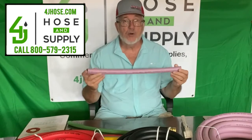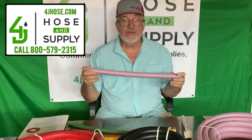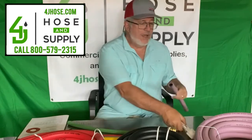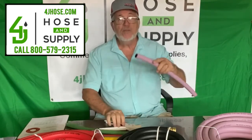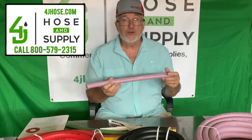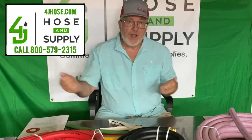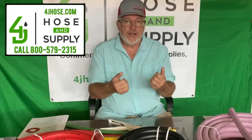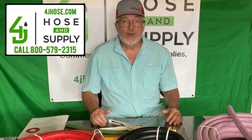This is the non-potable water hose, also called reclaimed water hose. You're probably familiar with pipe and PEX tubing, but this is something that goes in between. It's a very durable hose, made to be outside, and it's very flexible — it can be cut with hose cutters. We sell it in a number of different sizes. It is coated and marked 'do not drink,' and it's for reclaimed water applications. This is good for golf courses and irrigation. It can help you avoid dealing with a lot of fittings and different pipe because it is pliable — you can work it around corners without the rigidness that tubing has, which can snap if you bend it too much. This excellent product is called the NPW, non-potable water hose, and it's available from FlexTech.